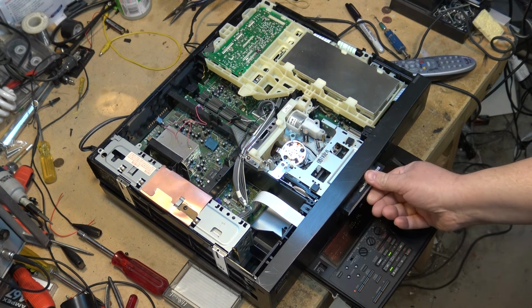Okay, I'll open up the control panel again. See, this is really cool. I have this control panel that slides out. So say the machine will play with this gear that's got a crack in it, and it'll play fine. We won't have any eating of the tape at all. But what will happen is you'll hear it. If I go into fast forward, you're going to hear it going tick, tick, tick, and then it'll spill. So watch. This is what happens with the cracked gear.